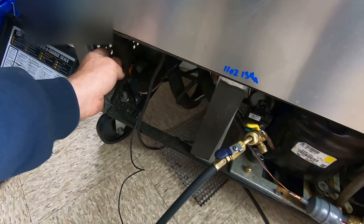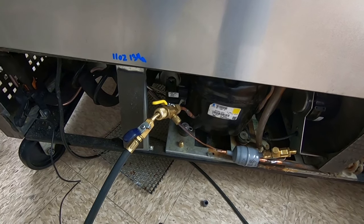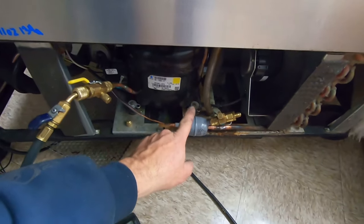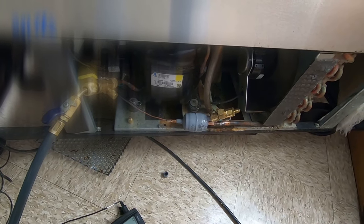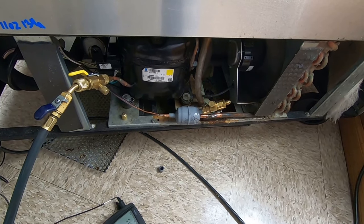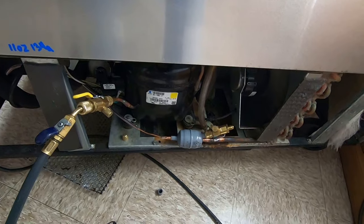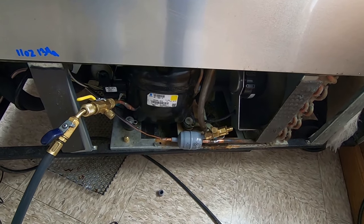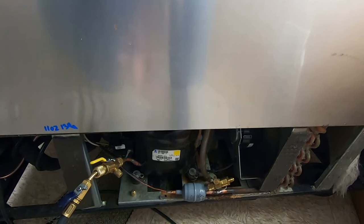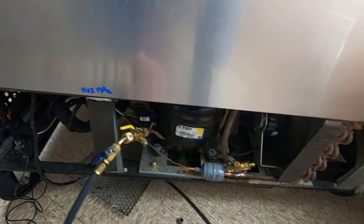It is coming back cool, but you don't want to jump the gun and go changing things. The fan's running and we're just going to watch our box temperature—things can change sometimes when they're running. This dryer here can possibly hold a little bit more than the dryer from the factory. Usually it will say on the dryer box itself what you have to add. I try to go with this O32 because it's usually pretty comparable to the pencil dryers. I don't like those pencil dryers because they've got loose fill in there and they seem to get plugged up easier. That loose fill, when the system goes low on refrigerant, will bake that oil, breaks those beads down because it's running so hot without enough refrigerant to cool the compressor—and that goes in and plugs up your cap tube, then the whole system has to be torn apart and cleaned.